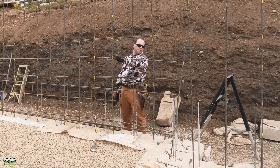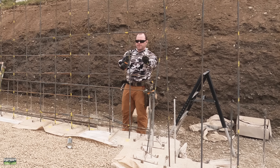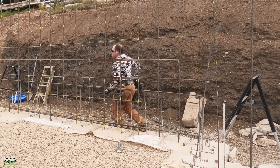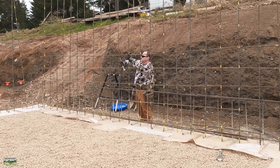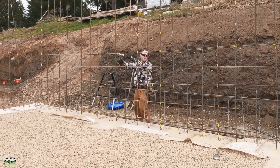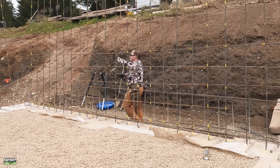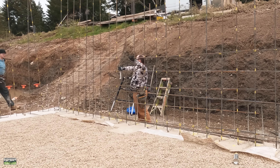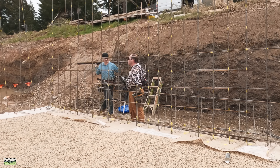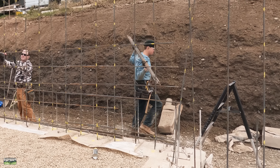The way we had this lined out: Tyler was drilling the holes so I could put the 10-foot sticks in place, and I gave Noah a whole list of sticks to cut. It was his job to manage himself — all our bar comes out in 20-foot lengths and he's going to cut all of those down to the lengths I give him. There he is hauling them as he goes. This is all about repetition and accuracy.